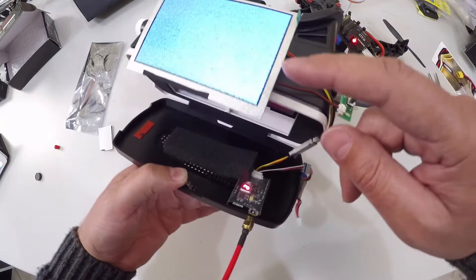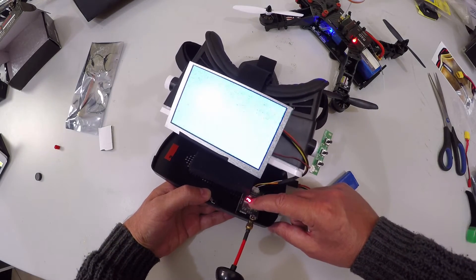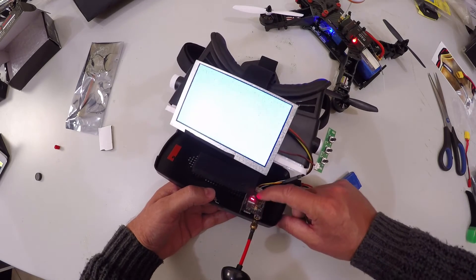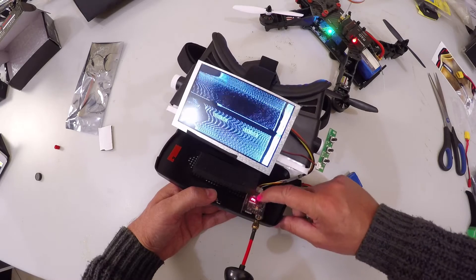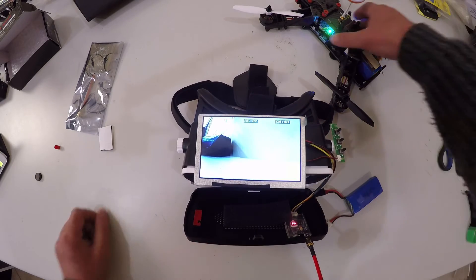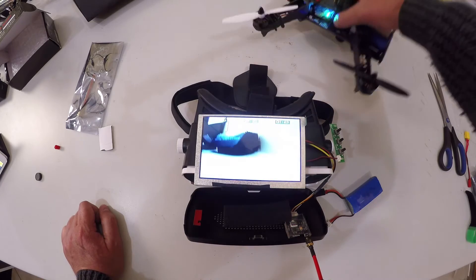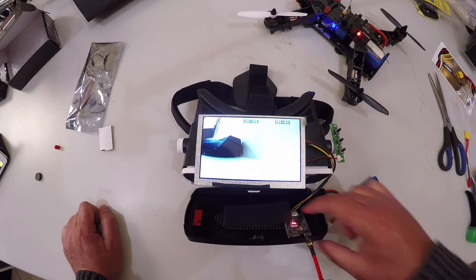I've gone through all the channels and we have not gotten a display yet. To change it from A to B, C, and D, you hold it down for about 1.5 seconds and there it changes to B. Now I'm on channel 1 — push it again. And there we can see we have a display, and now it is working. Our FPV display is working, and we can select and change our channels — that is how you do that.